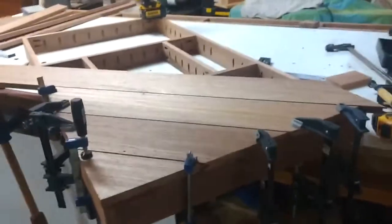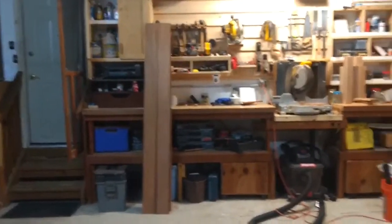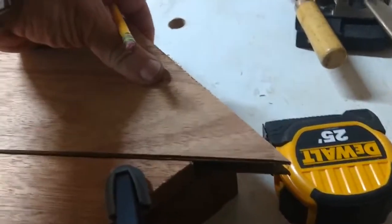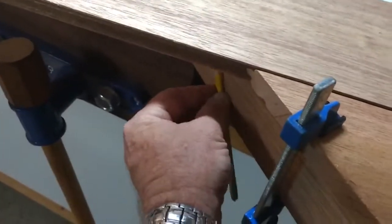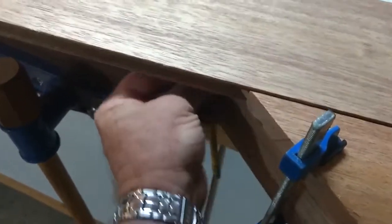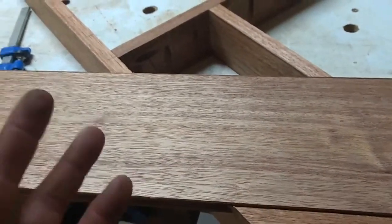Just piecing together the top of the board. I have a bunch of the tongue and groove already planed up. What I do is go over here, fit it in nice and tight, and leave about an eighth to a quarter of an inch overhang. On the end where there's a lot of overhang, I just take a pencil and hold it flat to the side of the frame — that gives me about 3/16 inch spacing. I strike a line along that board, then remove it, take it to the chop box, cut it, and that way I have the least amount of waste.